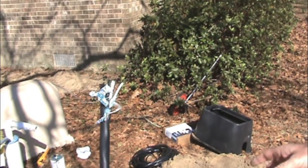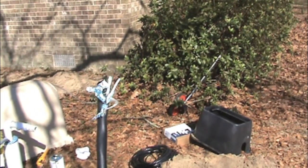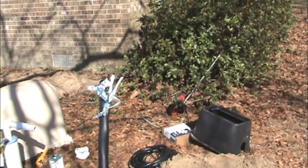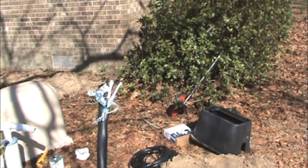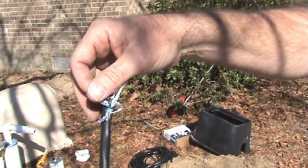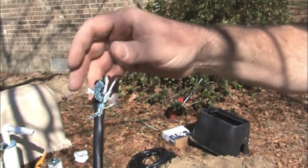In this installation, this wire is going to make a home run right back to the air card. Of course, we keep the polarity correct — red to red, black to black. Also importantly, notice this is a shielded cable. This is to keep out any electrical interference.